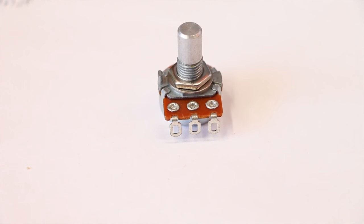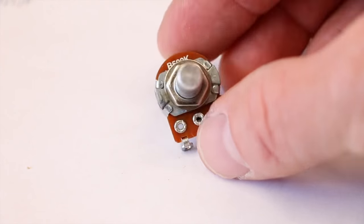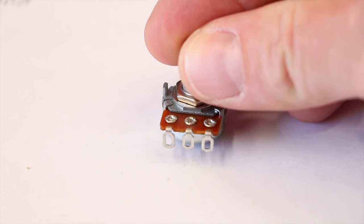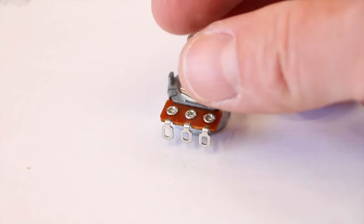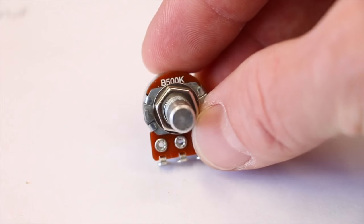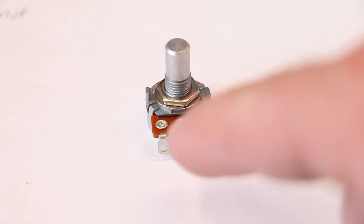For the potentiometer size, I'd use a 500k or 100k. The lug on the left connects to ground, the one on the right connects to that output capacitor, and the middle one goes to your output jack. You'll need to solder the wires to the pot lugs, much like you did the jack. And that's the gist of breadboarding — it lets you build a circuit very quickly and easily without much soldering. If you have any questions or comments, please comment below, and we'll see you in a couple of days.